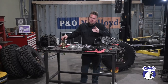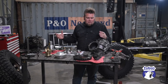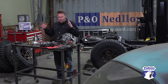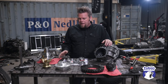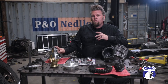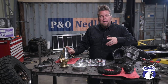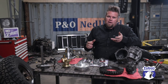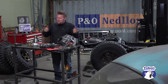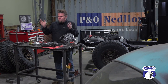One of the beauties of having 9-inch axles in a rig is that you can build the entire third member out on a bench and upgrade every single part of it. I'm using a Yukon Grizzly Locker in the back — that's a mechanical locker that senses wheel speed and locks up. Up front I'm using a Yukon Ziplocker, which is an air actuated locker, so I can unlock and lock the front differential, making it easier to turn on trails in four-wheel drive.